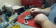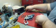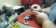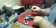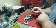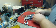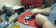Always goes there. Now on the older ones, these two screws now, see on the new one, it has a spring-loaded plunger on it, like that, okay? And that goes in the front, and that keeps tension on your yoke so it doesn't slide out of the gun when you open it up. On the older guns, it has a screw that's just like one of these here that's been cut to size so it's the correct depth.